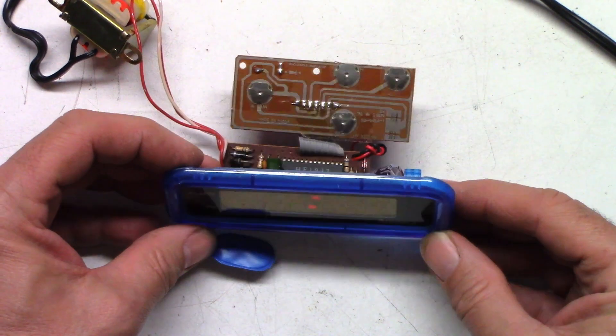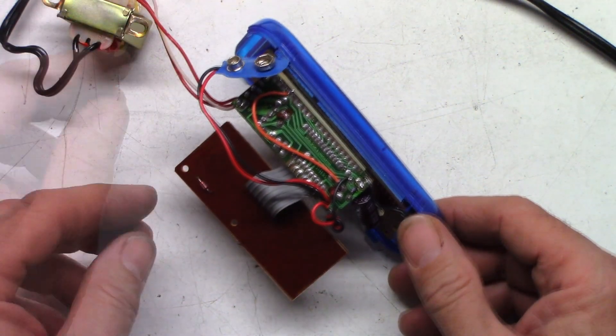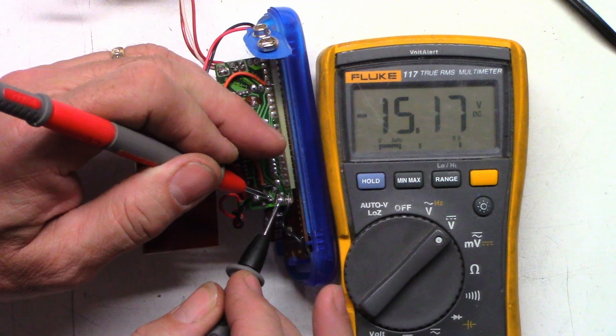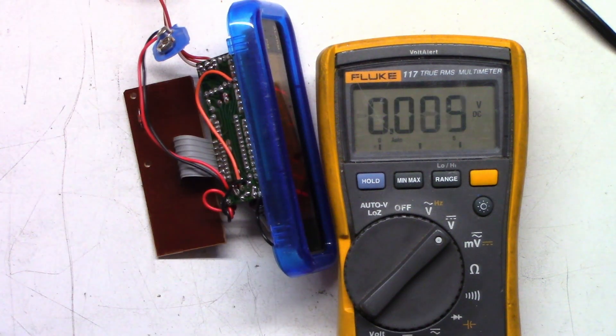Let's see if we can get this thing back together. But first, let's go ahead and measure the voltage across this cap when it's operating normally and just see what the voltage actually is. It is 15.17 volts. I could definitely get away with a 16-volt cap, but I'd rather see a 25 in there — they were pushing the limit at 16 volts. They really should have used a 25-volt cap. Probably would have lasted a minute or two longer, but hopefully I can get another 20 years out of this thing in my garage.